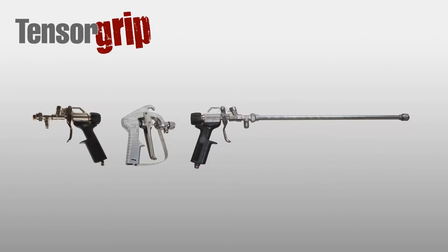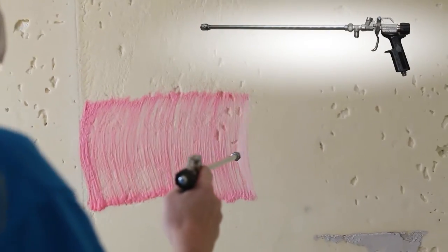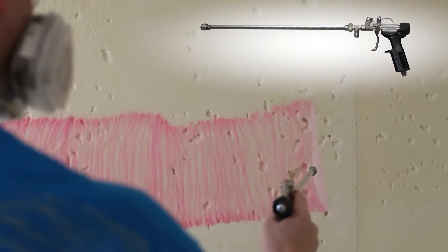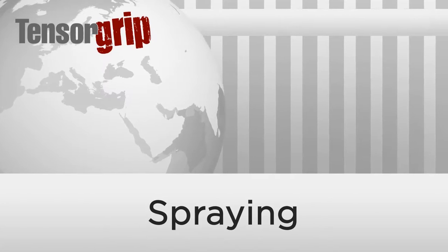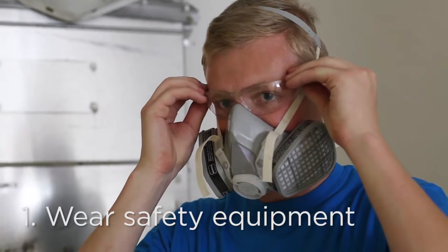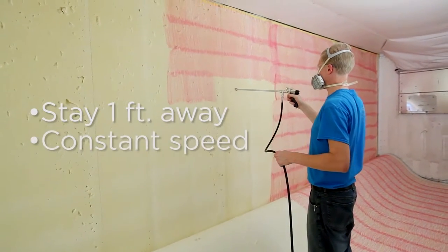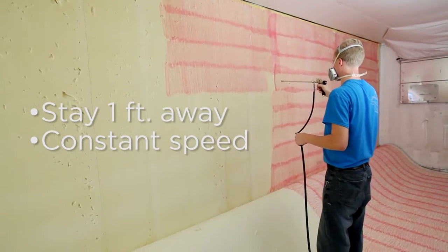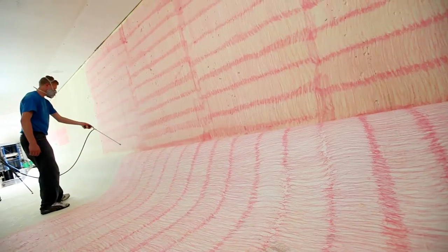There are three versions of our spray gun. The M105 wand gun with the 8002 tip is recommended to give a 10-inch to 12-inch wide spray for maximum application speed. Start by wearing proper safety equipment. Stay about a foot away from the surface and move at a constant speed. Going faster will make the coverage lighter; going slower will make it thicker.